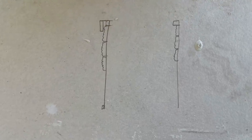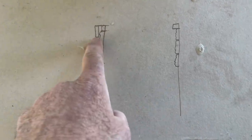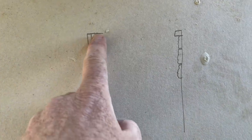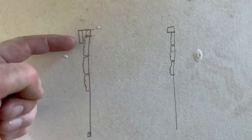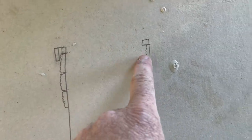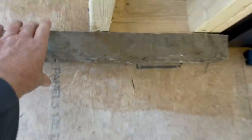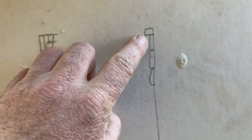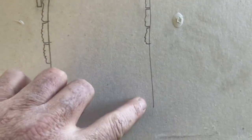I've got some beautiful scale drawings here. We're either gonna do this, where we do a piece of trim over top, up top, so that you don't see this teeny row. And we can actually shoot that right through because you can shoot nails through this. Or second, we might use this ledge stone, which is about 2 inches, which is about the right size, and put it up top so that we have nearly a full row at the bottom.